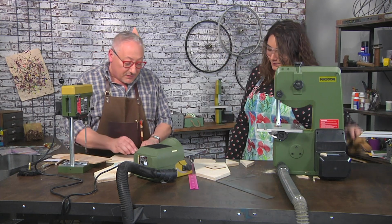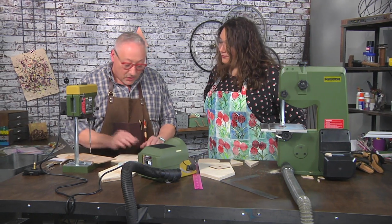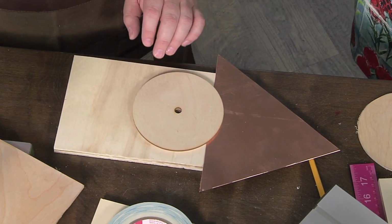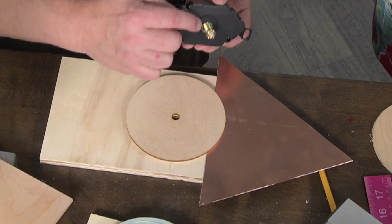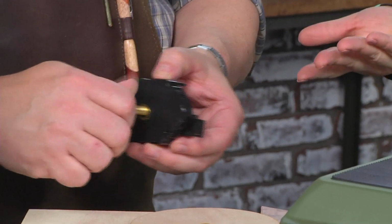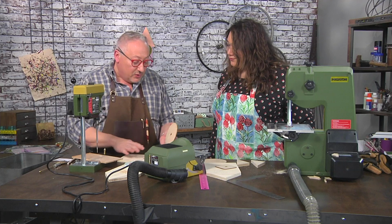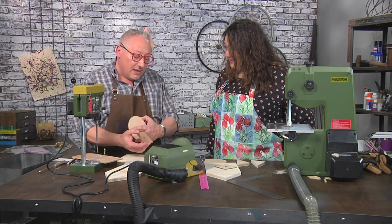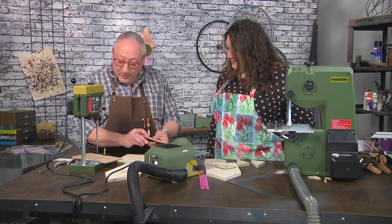No. And now we have to line up. Remember, we need 3/4 of an inch, our spacer and our circle. And why do we need 3/4 of an inch? Because this stem is 3/4 of an inch. And this is just a ready-made clock mechanism that you can buy. Absolutely. So I don't want to glue this because we still have to finish it. And there's all different ways we could finish it. But I would put some dry adhesive tape on the back, lining it up as a pane.